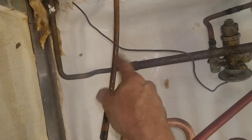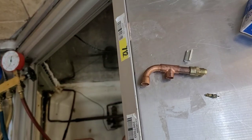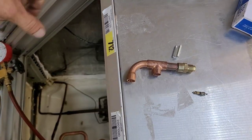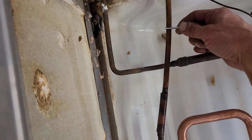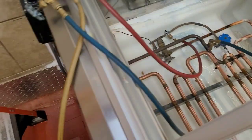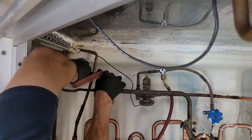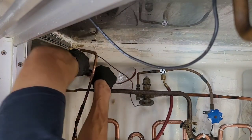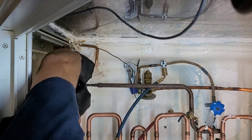I can either isolate it from here and cut it out and loop it here, or I can do it over here — I think I'll do it over here; I have more room to work with my tubing cutters. Watch your cylinders — make sure they don't get hot. This piece is going to go right down there perfectly; I'll have a stub going out that way. I'm going to cut my lines right about here and right about here. Once I take this one loose it'll scoot over and fit perfectly. Always sand before you cut, and when you sand, go wide and bigger. That way after you cut with your cutters you'll have enough for a coupling to slip on and still be soldering onto something clean.